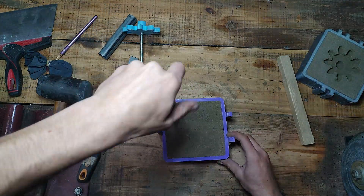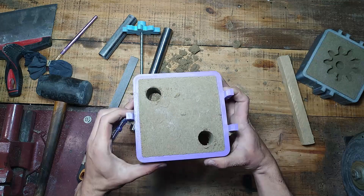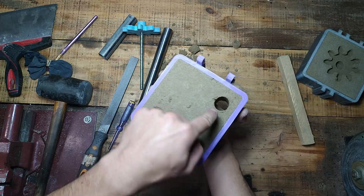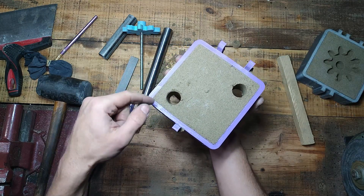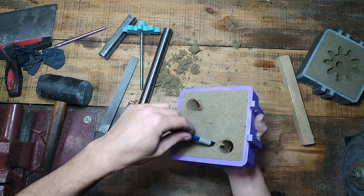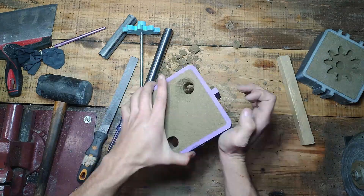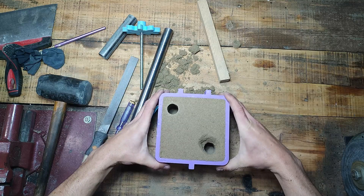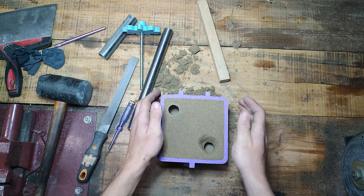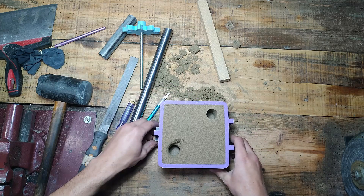Injection parts. As the gear is bigger, I'm really close to the gear. So it's good, but at the same time it's bad, because I need to go on the edge here so the aluminum can leak out. So I'll make sure I put a lot of pressure. I apply a lot of pressure on this side and push down to make sure the sand is really in contact with each other so that there is no leak. Normally it will be fine.